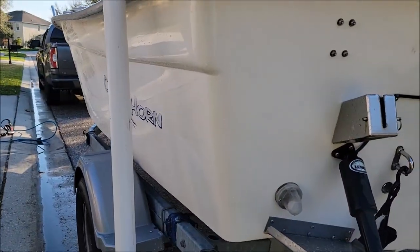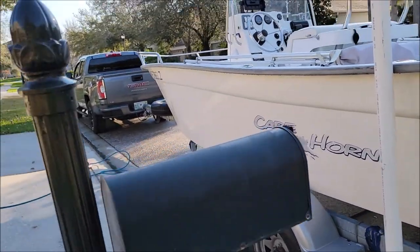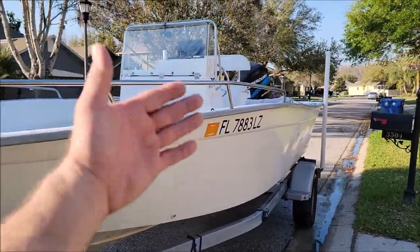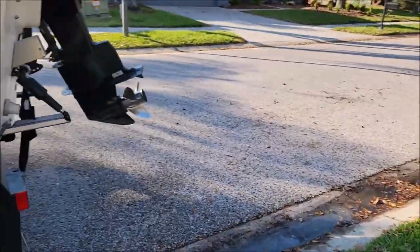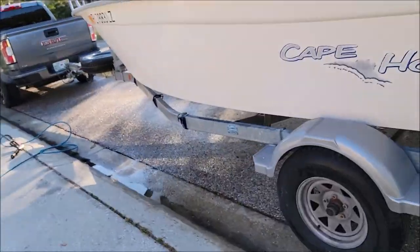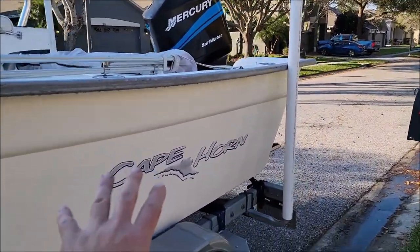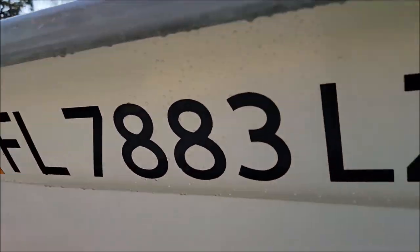I have more videos for that — this is really easy to correct. I actually have a sandpaper that I had specifically designed to cut this particular coating fast and smooth. Then with the new Oxidation Assassin from detailjuice.com's new Pro Marine Series, if you're using Infinity Marine you'd be able to use that. If not, Impeccable Polish or Smart Cut would be what you'd want to polish the sanding scratches out. This side looks amazing — I sanded all the orange peel out, then compounded with the Oxidation Assassin from the Pro Marine Series, and left it there.